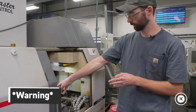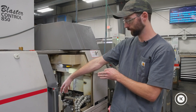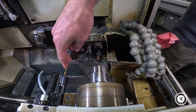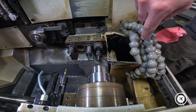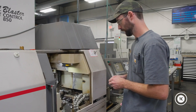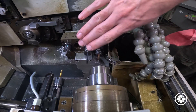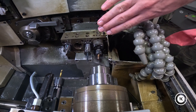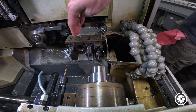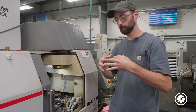Something to be aware of: when you're running tools on the sub-spindle and the backside, these are pretty much in line. So if you're not careful with your lengths and how far your tools are sticking out, they're going to hit. This spot drill is stubbed up pretty short so there won't be interference issues. But when we come over to knock our part out, this tap sticking out could interfere with one of these tools — and it's something you want to be really aware of. Run it through really slow when you're running your part through until you know all those tools are going to clear. You may have to adjust your lengths, set some tools farther back, move them around — you might have to take this tap and put it in 32, or take this drill and put it in 21, to get the tools to mesh correctly without hitting each other and breaking.